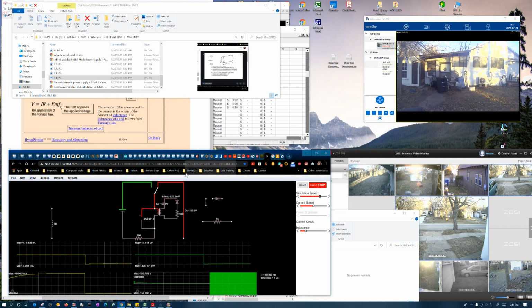So anyway, if you actually follow the fact that E equals 1/2 LI squared, and plug that all in, you realize that this thing's storing, at 4 Henrys, about 5 nanojoules or 5 millijoules or something like that. But anyway, if you do the calculations, it works out the way I was thinking. Since it's a 10-to-1 ratio, it should be 10 times that 50 milliamps, or half an amp. What I wasn't sure of is if it was going to force half an amp through our resistor or not. Because if it did, it's the same resistance, so the voltage would be way up. It should produce a 50 volt output instead of the half a volt output you would expect based on it being a transformer.